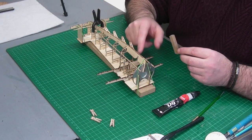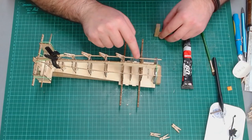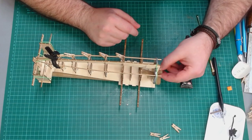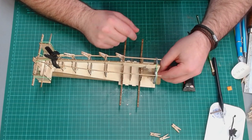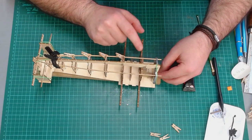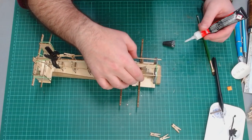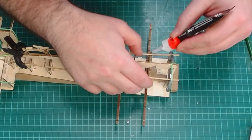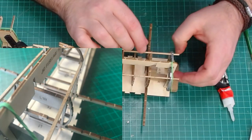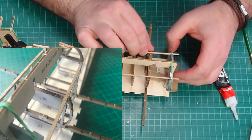I don't need wood glue on this other one — I'm just going to super glue this section in, because it's got a little bit of spring on it. So I'm just going to super glue it down. First of all, I'm going to get the little square in, make sure that's nice and level. I'm going to push this one back, pull a little bit of super glue just down the joint, square the part again, and just push and hold those two parts together.